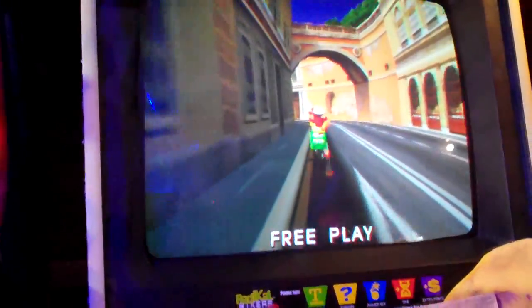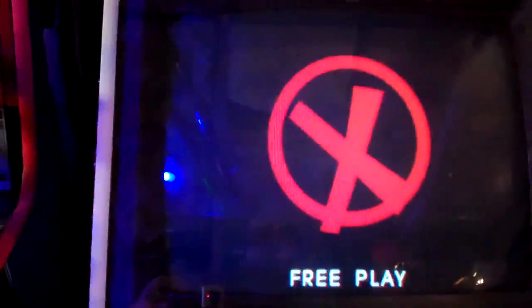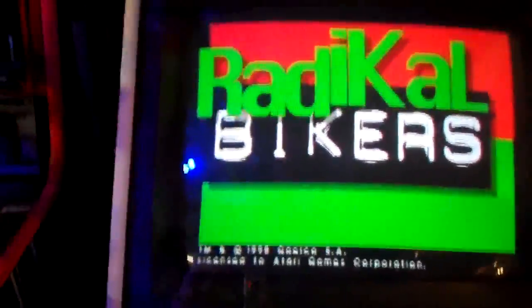So I'm just going to do the cap kit and see if that fixes it. This actually had a tag from the B+ voltage being fixed before. But the one thing I'm not enthused about is that this has got 48 capacitors to replace in it, which is a heck of a lot of capacitors. So that's not something I'm all that excited about either. And this thing has got like a bajillion connectors to be replaced, and lots of soldering and lots of connectors to put on. So that's not all that exciting.